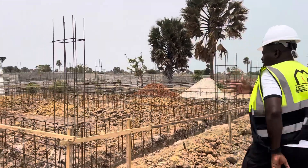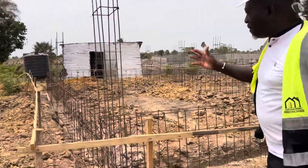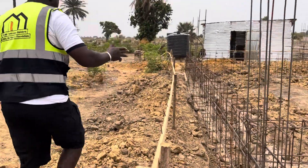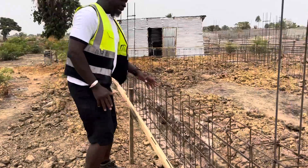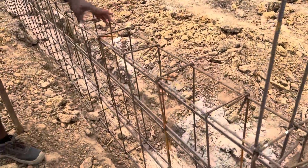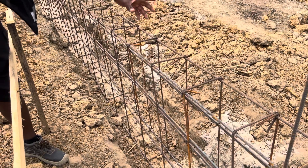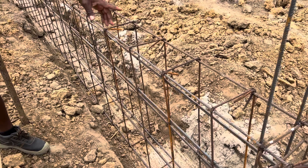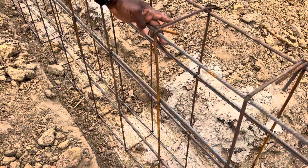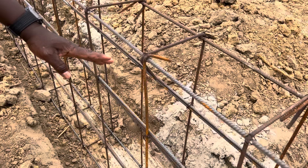This is what we got at this project. You can see all the ironworks in place, everything in line. All our iron in place. These irons are 10mm by 8mm — we're using the 8mm as our stirrups. You can see the angle whereby this locks in. This is a 135-degree bend that the iron bender makes, because this is the best way to lock in the iron rods.